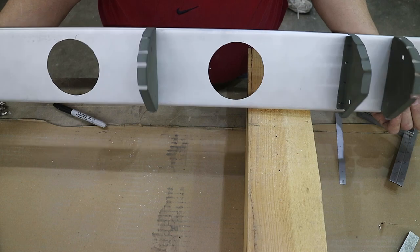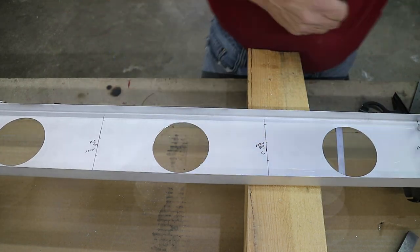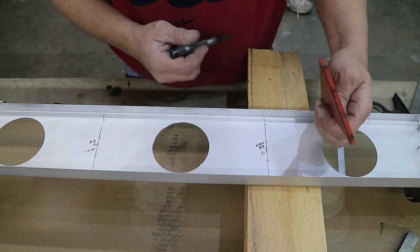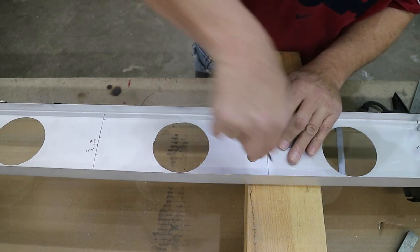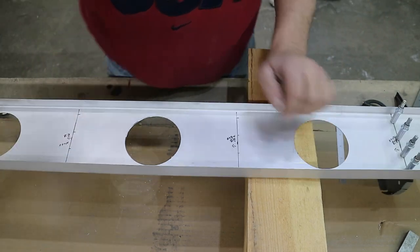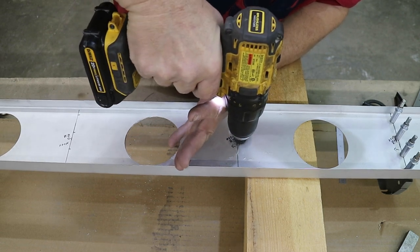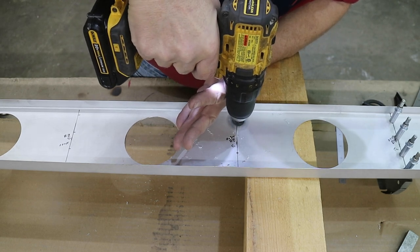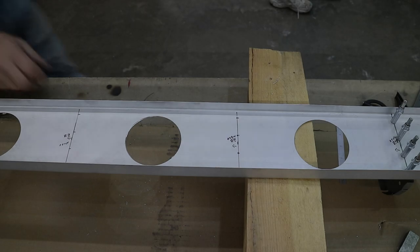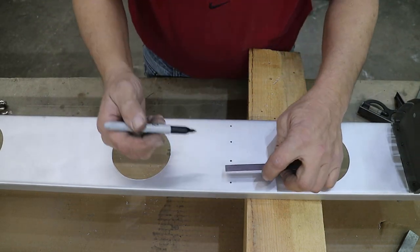I'm attaching the nose ribs. I went to the layout lines I have and marked out my rivet locations - I 3D-printed a little right angle to get in here and do these lines. I marked on the edge where I wanted the rivets so I could reproduce it easily. Center punch them all, bring it over and drill them all. I need a mark on the other side to tell me where the ribs should be located - that's going to be one quarter inch off this hole.